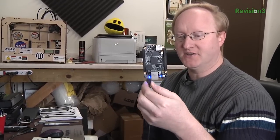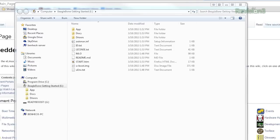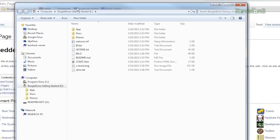There are four basic ways I'm going to show you to connect to your BeagleBone Black. The first way is quite easy — you just stick a USB cable into it, and by default it will act as a mass storage device, and you can also network into it over the USB cable. This BeagleBone getting started drive appeared on my computer.